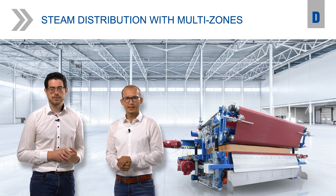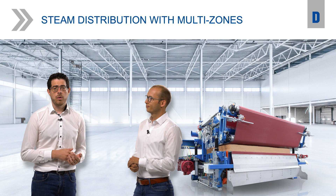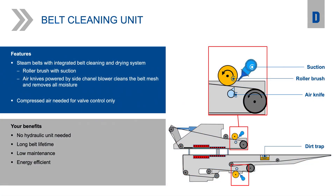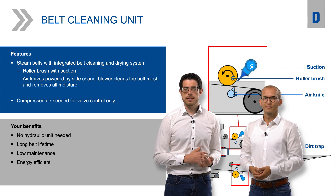What does a good performance mean if the uptime is not ensured? What are we doing on this, Johannes? This was the reason why we focused on a machine with good self-housekeeping. The main part of the belt cleaning is a rotating brush, together with an efficient suction to remove the dust from the belt surface. At each belt, an air knife powered by a side channel blower cleans the belt mesh and removes all moisture. Using side channel blowers for belt cleaning instead of compressed air is much more energy efficient.